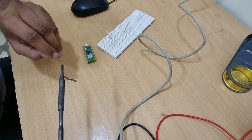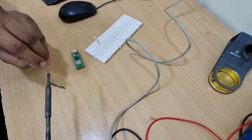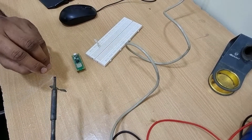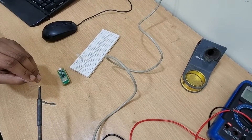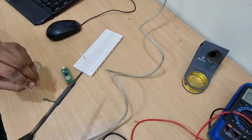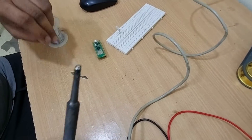The simplest way to clean it is to have some solder applied onto it — lots of it, I would say — and then simply wipe it off like this. Do it two or three times and you will get a clean tip.